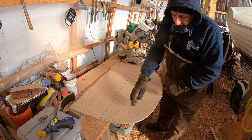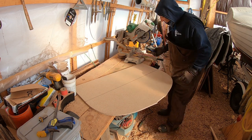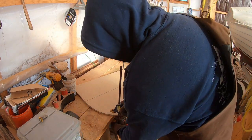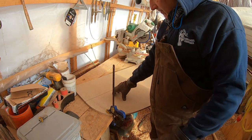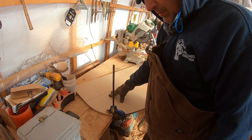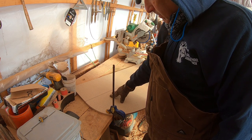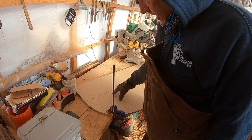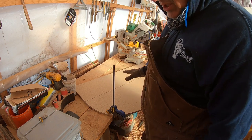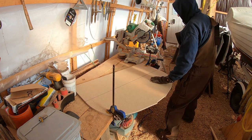What I need to do is round off this side and this side — so there'll be four separate steps. Make sure I leave enough clearance for the router here. Clamp it on both sides. Now this is MDF, not MDO. MDO is signboard, which is plywood with craft paper on the outside of it. This is MDF — medium density fiberboard — it's like really fine chipboard. It's very stable, but it's also a little bit fragile, so we don't want to horse on this too much until we get it in where it's going to be and attached to something. We're going to clamp it on both sides because we're going to be pushing down a little bit.